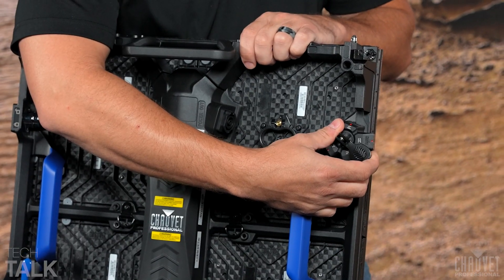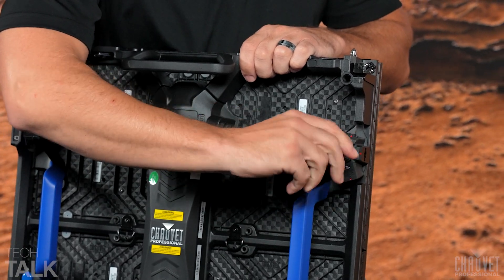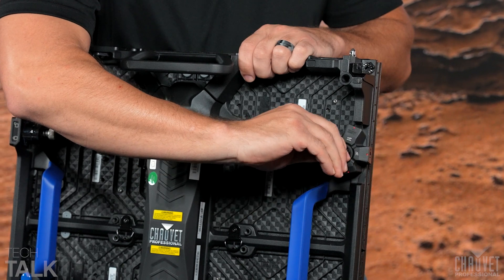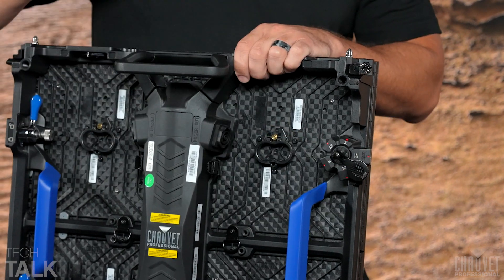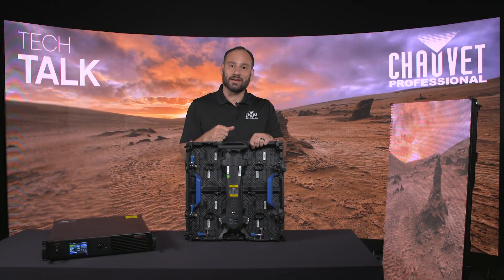Instead of offering curving hardware as an accessory like in the past, we're now offering included and integrated curving hardware. We can do both concave and convex curving with RIM. All you have to do is flip this lever up right here and turn it to the position — the positions are spring-loaded and notched, so when you get close to the position it'll pop into place, as noted by the clicking noise. When you've achieved the desired angle, just press this down gently with your thumb. You can do both five and ten degree concave curves, as well as two and a half and five degree convex.